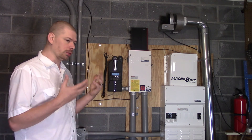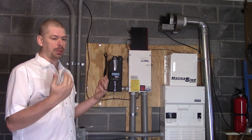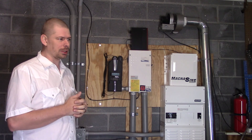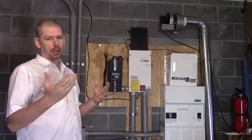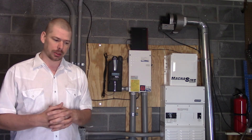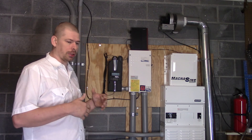If you had a much larger battery bank, like 36 lead-acid T-105 batteries, that would be more than sufficient — about $4,000 worth of batteries that'll last you 10 to 15 years. But I bought the maximum I could afford at the time, which was 12 batteries, and then I switched to a 48-volt system. That narrowed me down to 8 batteries because you can't put more batteries in series with that — you just can't add batteries to it. That's totally fine, no big deal.